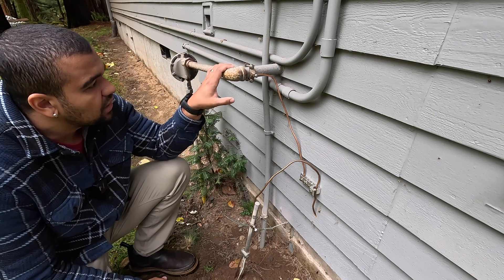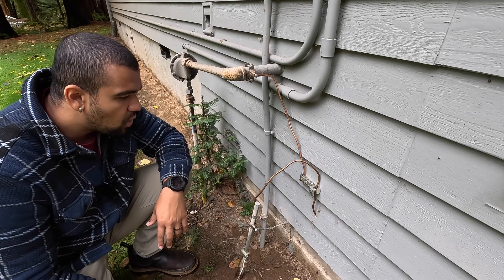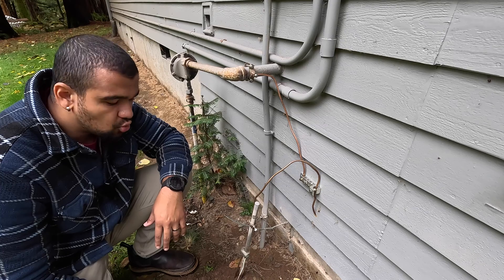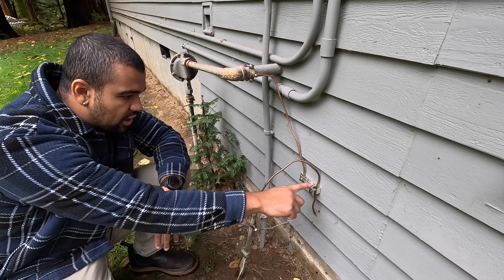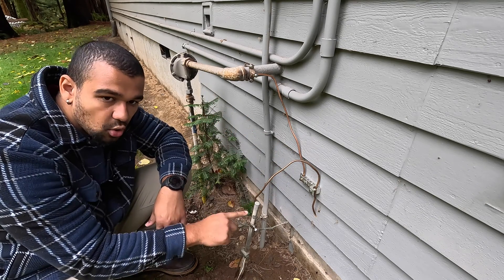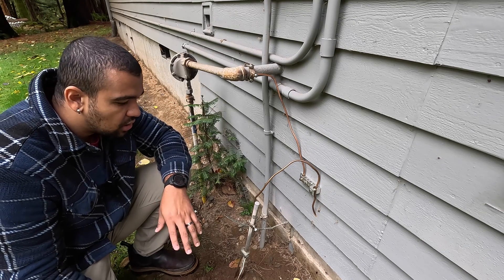I have my incoming gas line going into my house grounded to a bonding kit here. This is why we made the grounding electrode conductor a number four wire — because I made a grounding electrode conductor connection here at this bonded terminal. The wire that goes out to your ground rods doesn't need to be bigger than a number six, but since this connection is a grounding electrode conductor, I sized this to a number four. If you only ran a wire from your electrical panel out to your ground rods, you only need to make it a number six. Making this a number four so you can bond other things to it is always a good idea.